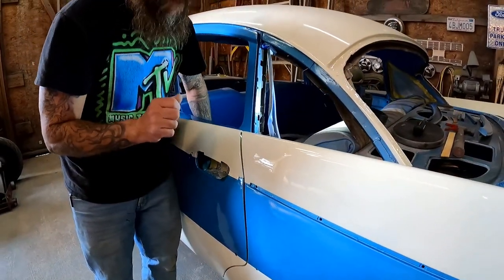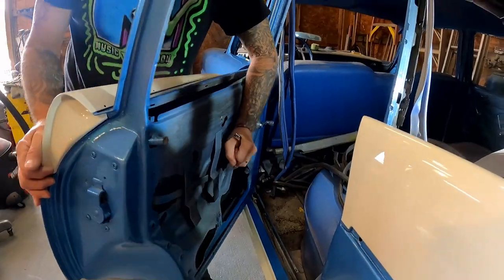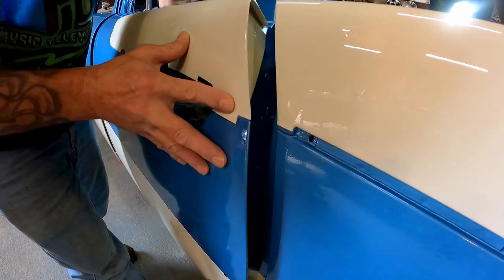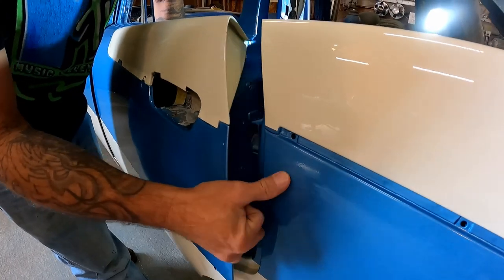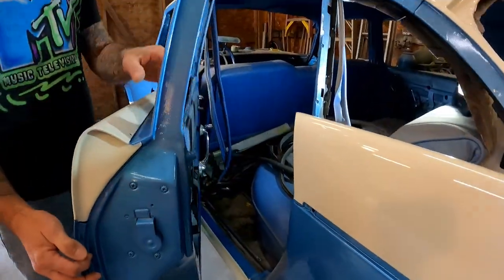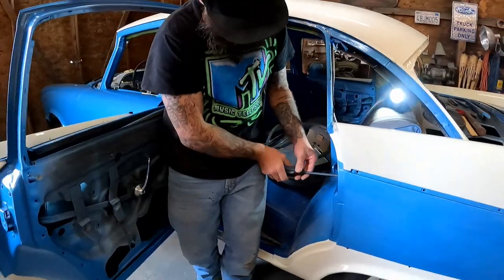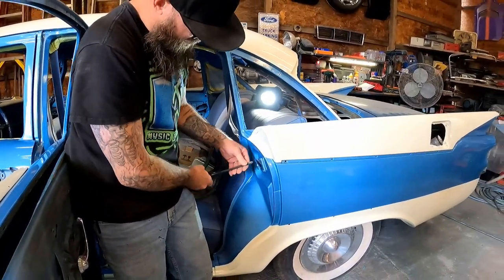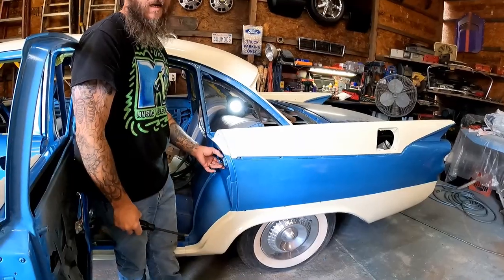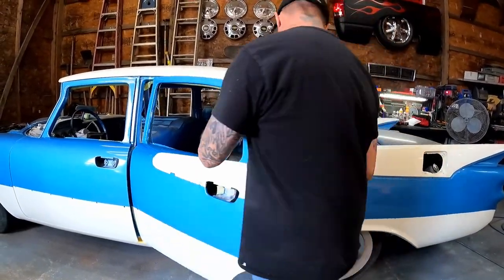All I did was put the latch in and just barely tightened it. A trick you can do is pull your latch open and hold it, then slide the door in and out and see if it's rubbing on anything. It's not really offering any resistance, so maybe hit it with just a little bit of oil and tighten it down. What I did was just barely tighten that screw up just a tiny bit — that way when you put it in there and shut the door it'll kind of adjust itself, and then you go back and tighten it up.